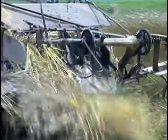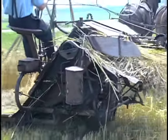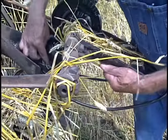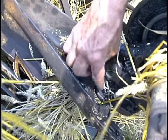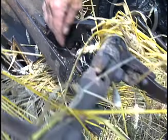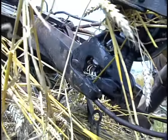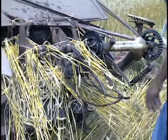It's called a billhook, a small tying mechanism in here, which takes the twine. There's your twine now, and it's down. And then this swings around, grabs the twine, and ties a knot and cuts it off, and also it's threaded in for the next bundle. This releases, and your bundle is shoved out by these arms as they rotate. They go around and they drop your sheaf out.